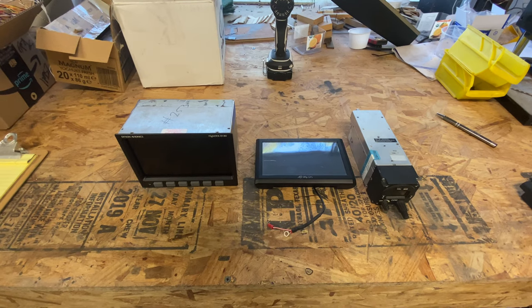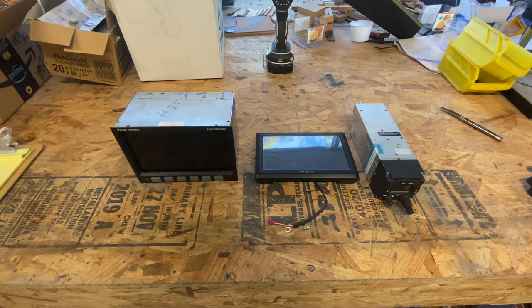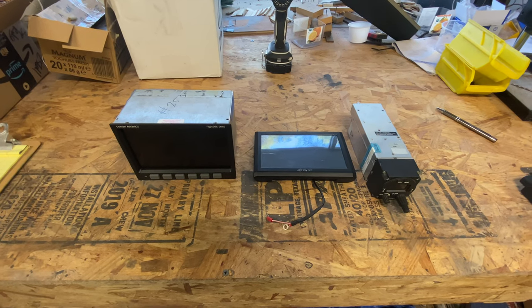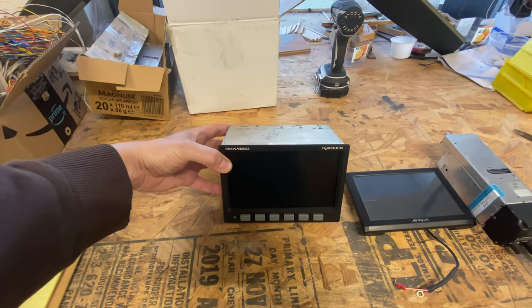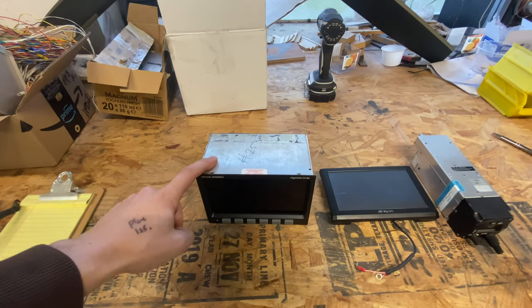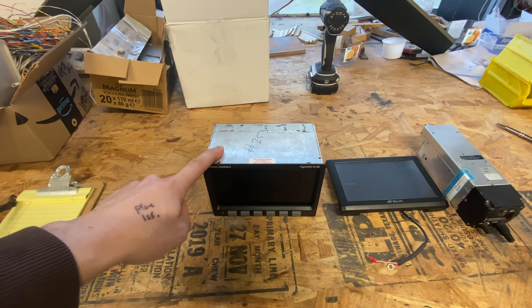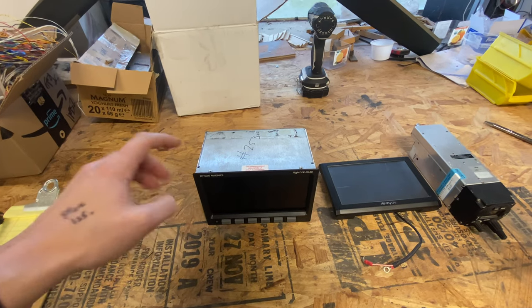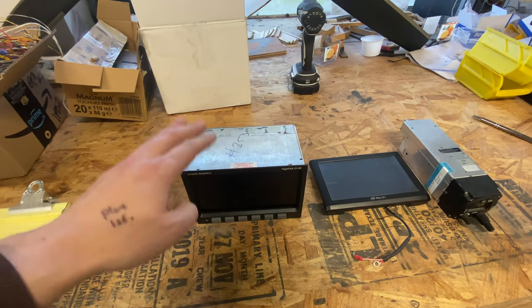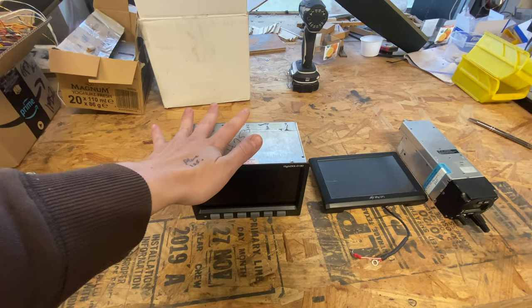So I've been waiting a while to get all of my avionics into the airplane because I didn't have everything I needed, but we do now when we get installed. Starting here, this is a Dynon D180. I got this secondhand. I'd been waiting a while to look for a good secondhand EFIS that I could use, and this one's perfect because it does artificial horizon, altitude, airspeed, everything I need, but it also does engine instrumentation. So this is an ideal installation.